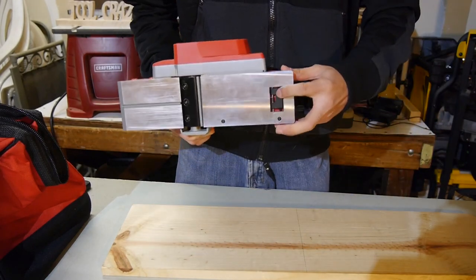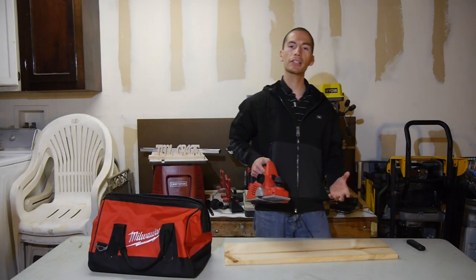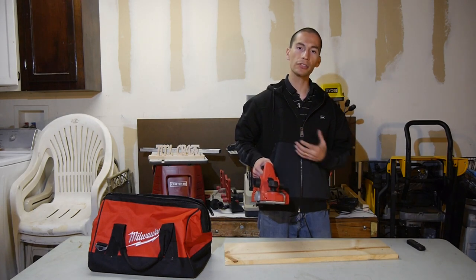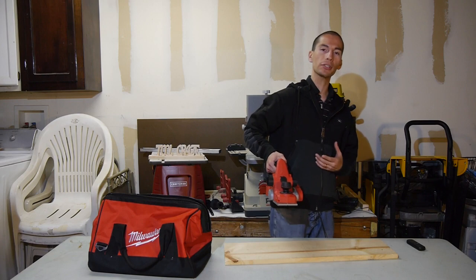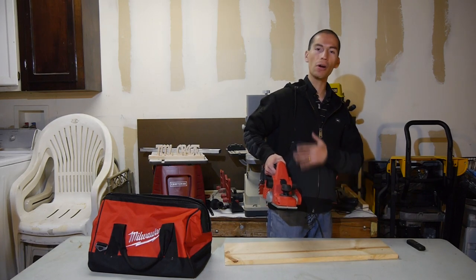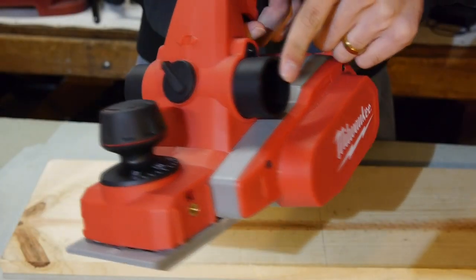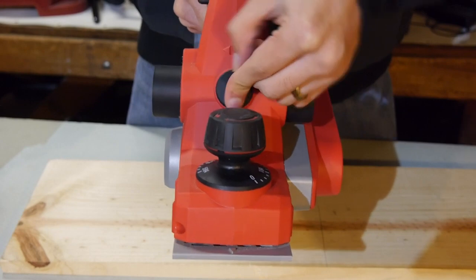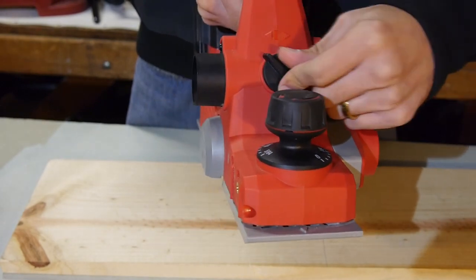You can also lock the tab in place if you don't want it to flip out on its own. All other electric planers have a dust chute, but most only eject dust on one side. This poses a problem if you happen to be standing on the side where the dust blows into, and you end up with your clothes all full of shavings. So what Milwaukee did was they made a double sided chute, and in the front you can select which side you want your shavings to fly out of. Bosch also has this feature on their cordless planer, but Makita doesn't.